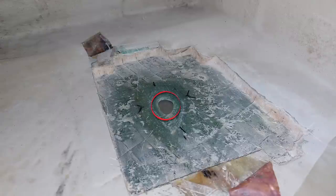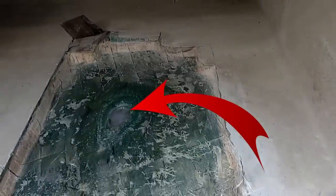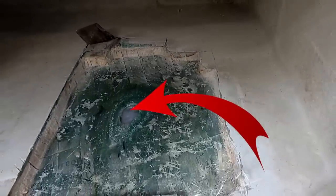With all of our materials ordered, it was time to seal the hole with the existing fiberglass we had on hand, as well as inspect the rudder and rudder bearings further. But first, Curtis scarfed the hull at an angle for the layers of fiberglass to grow in size and create a flush surface. He then used some filler from the inside while using plastic on the outside so it would not leak through the hull.